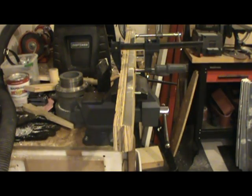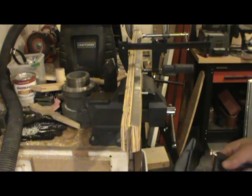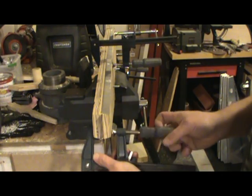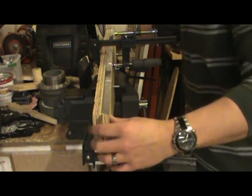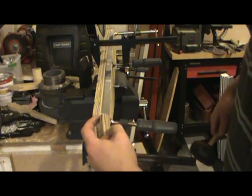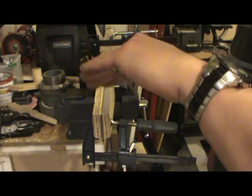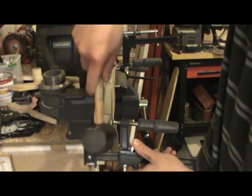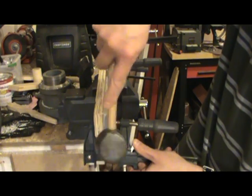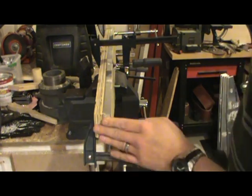Because I'm going to do the rear flange, I want to put this rear clamp back in place. If you don't clamp this tightly when you go to bend your flange, the material just inside where the crimping location will actually have a tendency to buckle up as the flange folds over — it'll buckle back on itself. So by clamping it tightly, you minimize that.